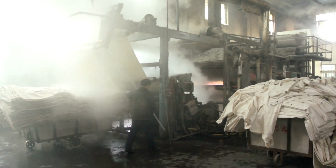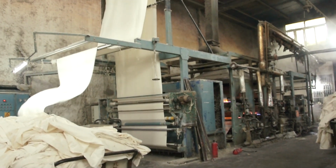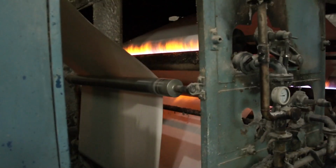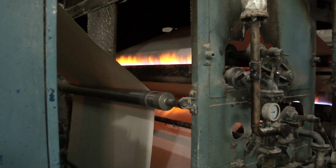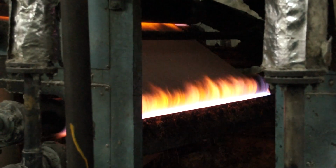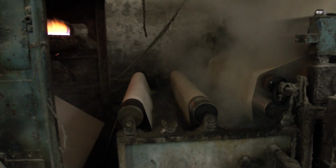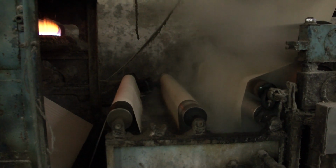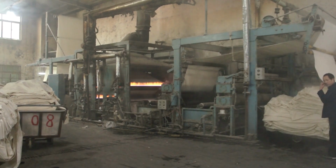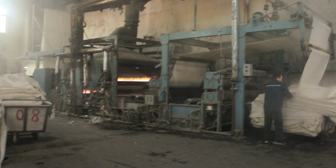Printed fabric production is made up of three basic steps: preparation, printing, and finishing. The first step in the preparation process is singeing. Cotton gray fabrics are pretty hairy, and these fabric fibers need to be removed prior to the other production steps. The gray goods are put into the singeing machine. The fabric is passed over brushes to raise the fibers and then goes under a gas flame at a very high rate of speed. The process burns off those surface fibers, and after singeing, the fabric's surface is much smoother than it was before.